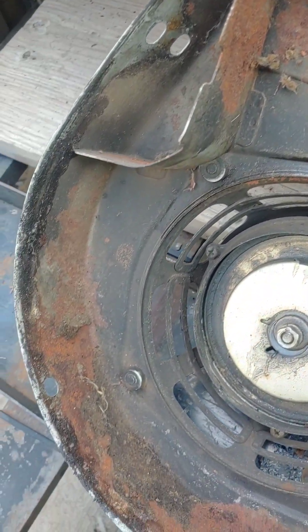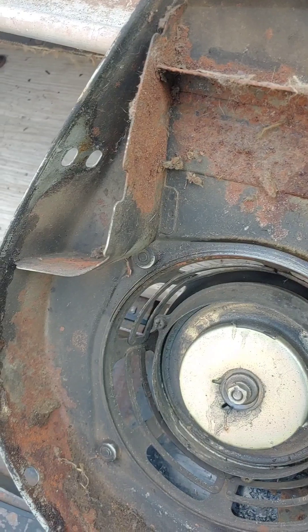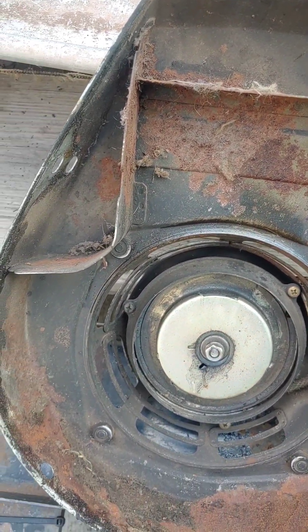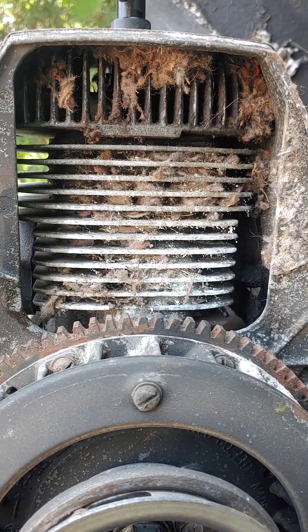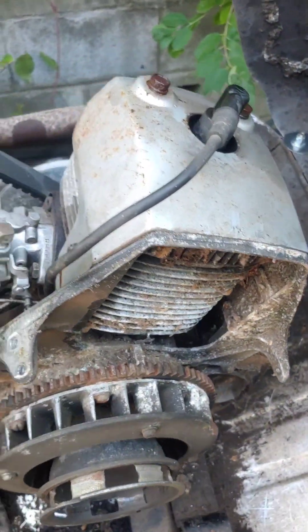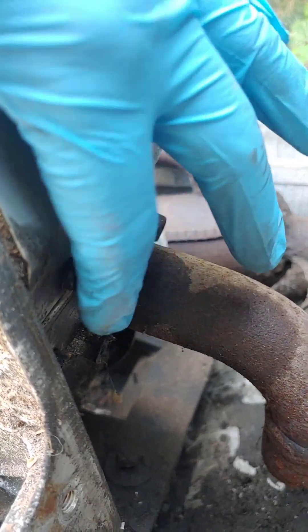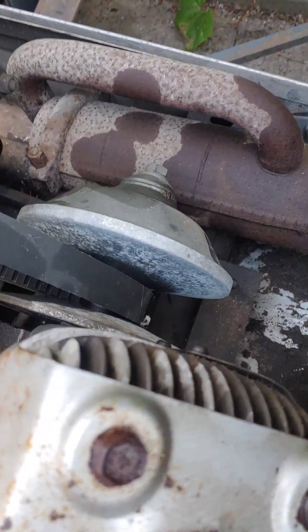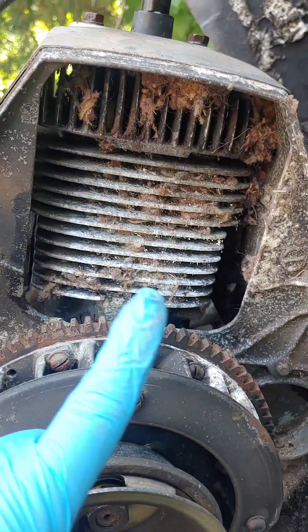This is all the evidence of that mouse nest inside of there, and with deductive reasoning, that's mouse piss that's caused this shroud to rust. In a little bit I'm going to do a real deep scrub on this and put some new primer and paint on it to seal it up good. While we got most of the problem, I still see there's a lot of crap inside these cooling fins. So our next step is to pull off these two half inch bolts and then there are a couple of flat heads here and also back here — the top one needs to come off, plus two more screws right here. Then everything will open up and we can clean out all the garbage in these cooling fins.